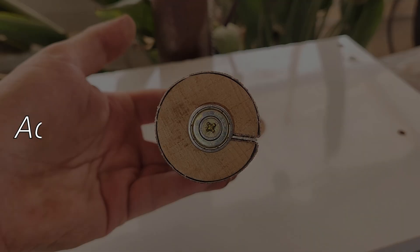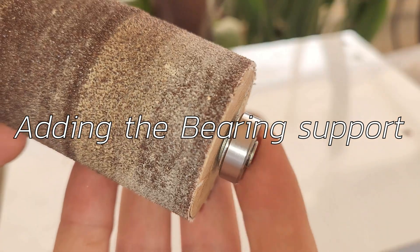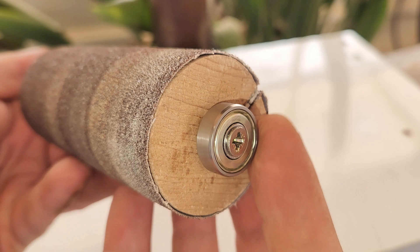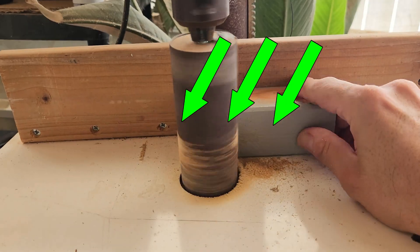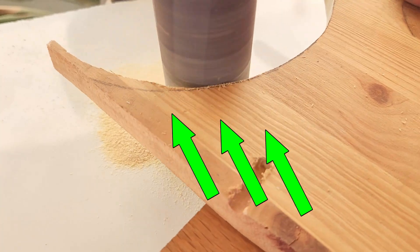The video you're watching now is the continuation of the project. In this video, I'm adding a support bearing at the bottom of the drum sander. But why is the bearing needed? The drill press mechanism is designed for vertical axial loading. Side loading — like pushing a workpiece against the drum sander from the side of the chuck shaft — can cause quill wear out and might loosen the chuck over time.